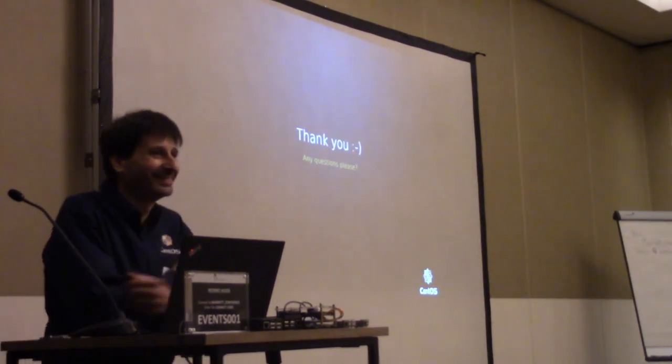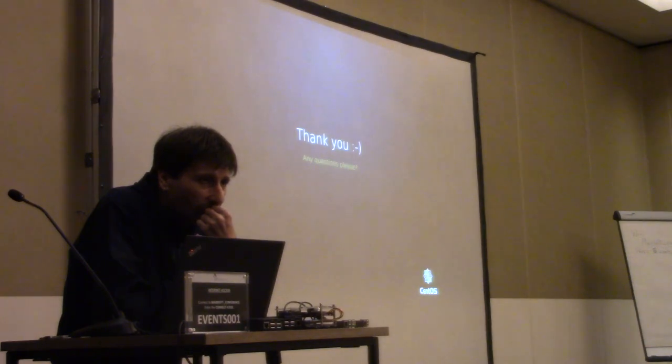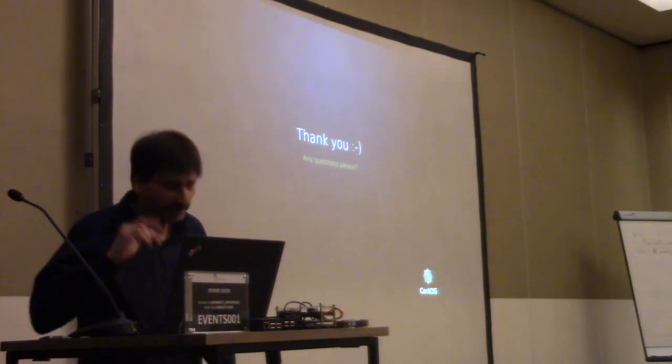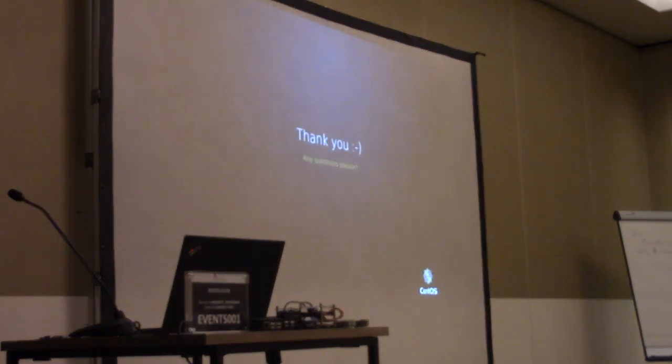Any questions? Or a comment regarding your last slide. Depending on the implementation of the bootloader, or whatever the board uses, the serial TTY is really your best friend, because sometimes you can actually control the bootloader already on the V24 level. Regarding your last slide, why is the serial connection important? Depending on the particular implementation of the bootloader, a serial connection is your best friend, because most of the time you actually can control bootloader behavior right on the serial TTY interface.